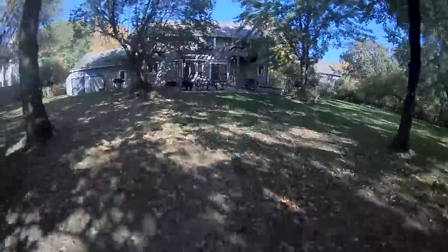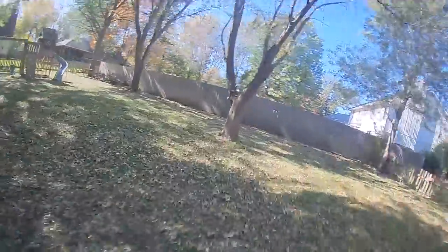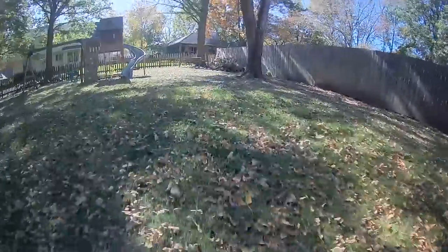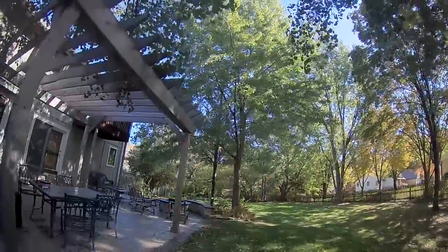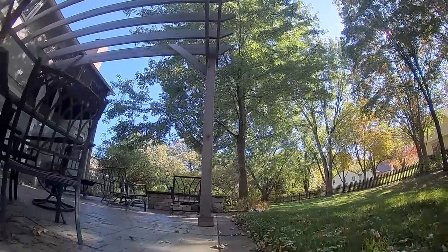I think the Tarsier comes with at least one ND filter, so in this case we have to spend a little more money for the finest-grain footage. You may also notice lines in the corners — that's been a long-term issue with the Caddx Turtle. Don't worry too much; it's fixable without re-soldering or sending it back — it's just a firmware reflash. Beta FPV has a support page on it, and Happy Model does as well. As we wrap up the flight, we're looking at about a three-minute flight on this.